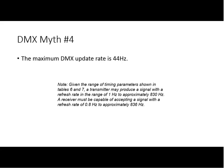However, there has to be a certain required length for the entire packet, which works out at, well, the new timings, I'm not sure, but somewhere in the neighborhood of 20 slots per packet. If you are below that, you will end up having to add padding to not go over the top speed. It looks like you're sending more bytes, but they're not there. The number on the original DMX 512 was 1196. The newer one is a bit lower.